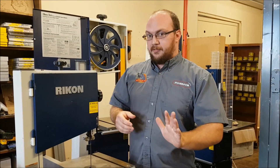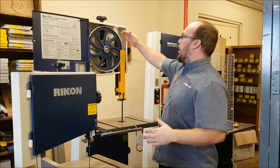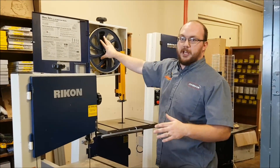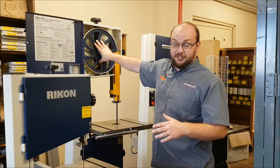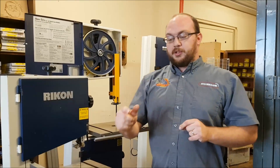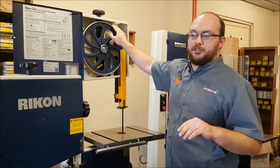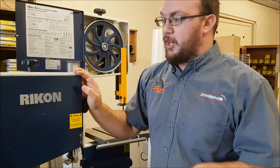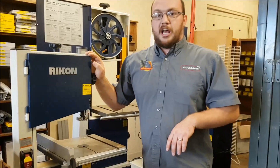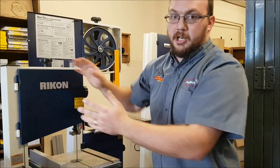You don't mention what kind of saw you have, but one thing that puts a lot of stress on band saw blades depends on how big a diameter the wheel is. The bigger the diameter of the band saw wheel, the less stress it puts on a blade. So if you have an 18 inch band saw, you can safely run a one inch or an inch and a quarter blade without worrying about that weld breaking. If you have a 14 inch, you can go basically up to three quarters — some guys will go to seven eighths. On smaller band saws, you're never going to run anything larger than a half inch or even three eighths, because they put a lot of stress when bending that thick blade around the wheel.